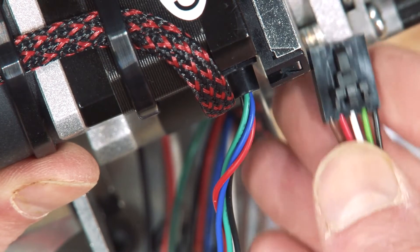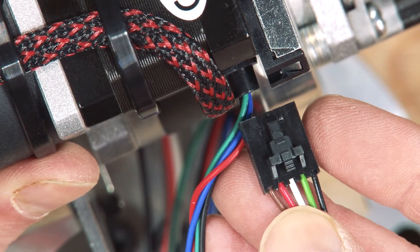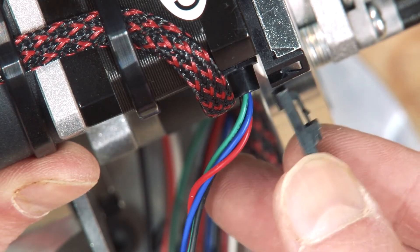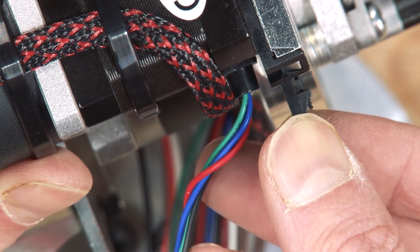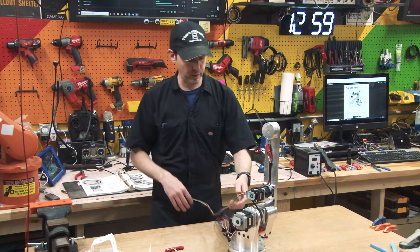So the next step is you're going to have an encoder cable that looks like this — with brown, red, white, green, black wires. That goes in with the clip towards the outside and just clips right in place. And then you've got your encoder cable in, which in the next video we're also going to give a little bit of an extension to. But for now you're done — you did a thing, you made a step.